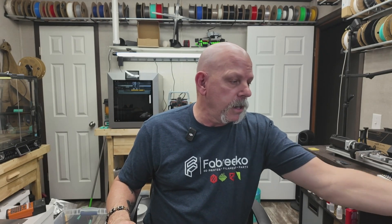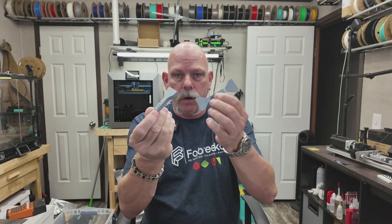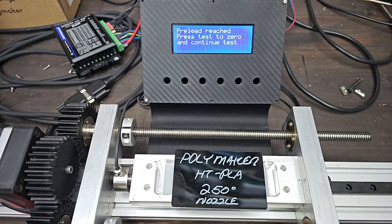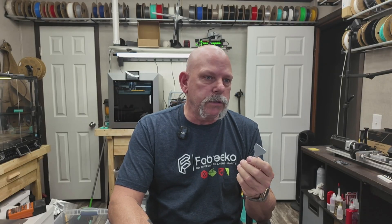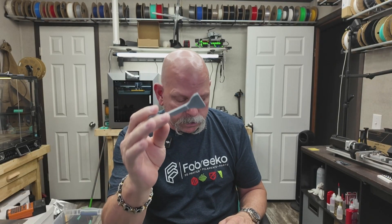Does raising the temperature of the Polymaker High Temp PLA help? Hell yeah. The first test I did was printing at 250 degrees — these here. These are printed at 250 degrees nozzle temperature. The tensile strength came in at 193.1. The original high temp PLA using Polymaker's recommended settings yielded at 174.64 on the X-axis. So 193 and 195 on these two — it did improve the tensile strength at 250 degrees.